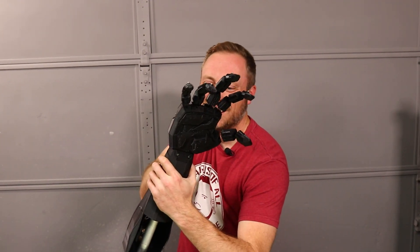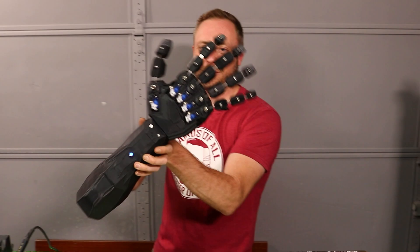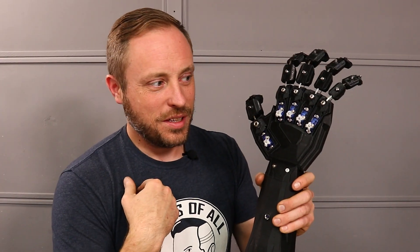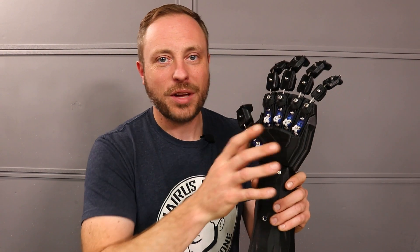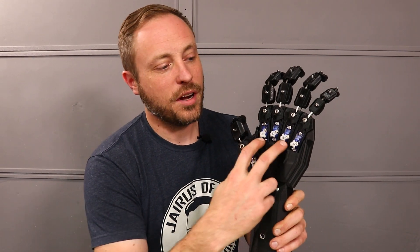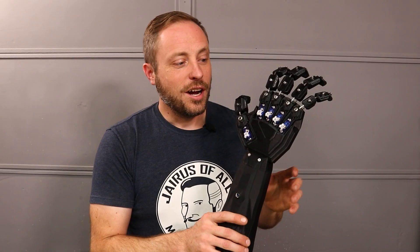One of them's working. I might need to pre-bend the springs a little bit — unless I just broke all the servos. I may have stripped the gears out of some of them. It's the next day — it's all fixed and it works great. I'm the one that screwed it up. I bumped the trigger to make them move to the right location and I hadn't trimmed the horns yet. They ran into each other, stripped all the gears out. Four of the five needed gear sets replaced, and I reversed the polarity on two of the motors so that they move past each other instead of whacking into each other. I'm really excited this works because this project is awesome for a lot of reasons.